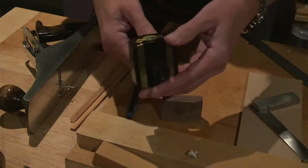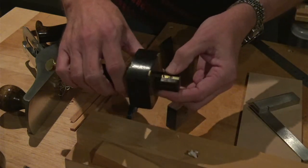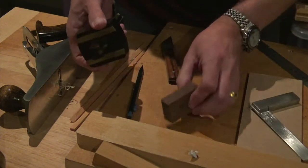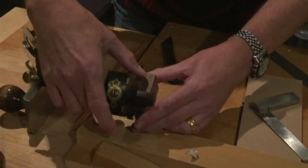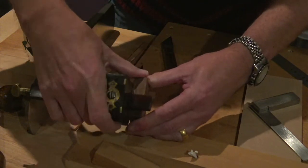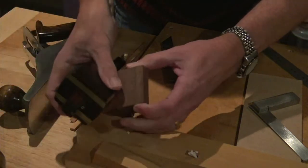And take a mortising gauge, set to the again the mortise chisel we're going to use, maybe very fraction wider maybe, and then we want to mark between those two lines on the edge of the block. So define the mortise both sides.